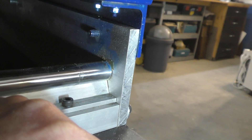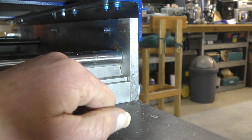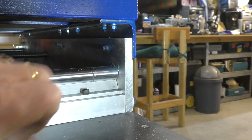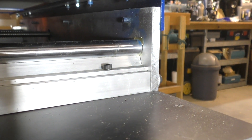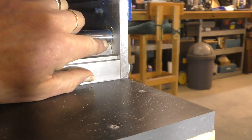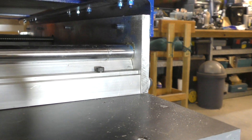To get the bearing housing exactly 90 degrees, it will be necessary to shim. I've used a little bit of brass shim — in fact I put two pieces in there, which is about a twelfth of an inch. Of course I mix inches and millimeters up as well. Really, all you're after is getting this the right length and getting it 90 degrees. That's the easiest fix for that problem.